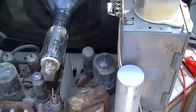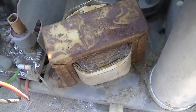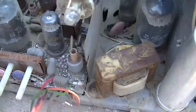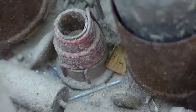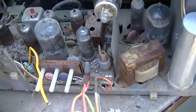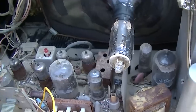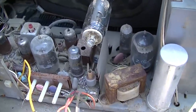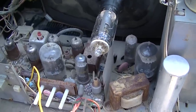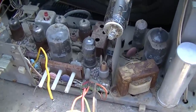But who knows, the flyback could fail. It's been exposed to the same elements. This transformer here could fail. It's been exposed to the same elements. The windings on the IF transformers are pretty coarse, so they're not going to fail. Look at how thick the wire is. But any of this stuff can fail from being in such an absolutely harsh environment. Some people think cigarette smoke is bad. Try leaving it out on the hot desert floor for 35 years. Anyway,